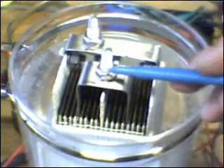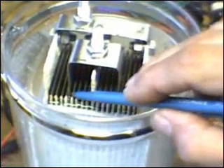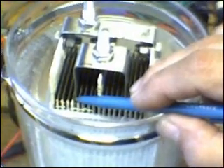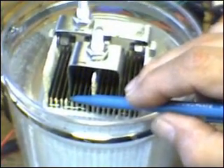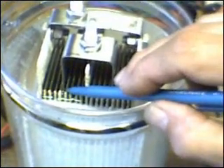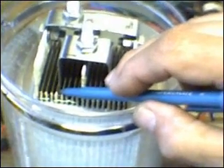Now we're going to take a close look at the reconfigured Zufra cell. You'll notice this is the negative terminal, and these plates extend down in between the original plates 4 and 5 inside the cell. All I did was bend them with a wavy pattern so that they fit nice and tight down in between these two cells and essentially short these out. There's no gas production between these two plates, and that's fine because what that gives me is exactly the number of charged plates that I want.